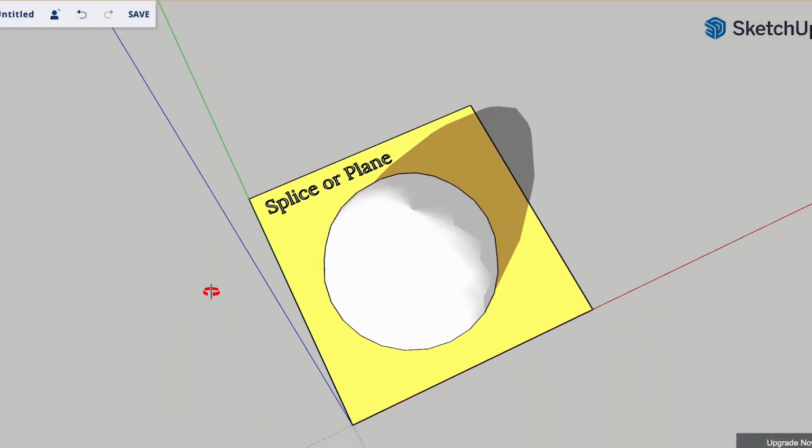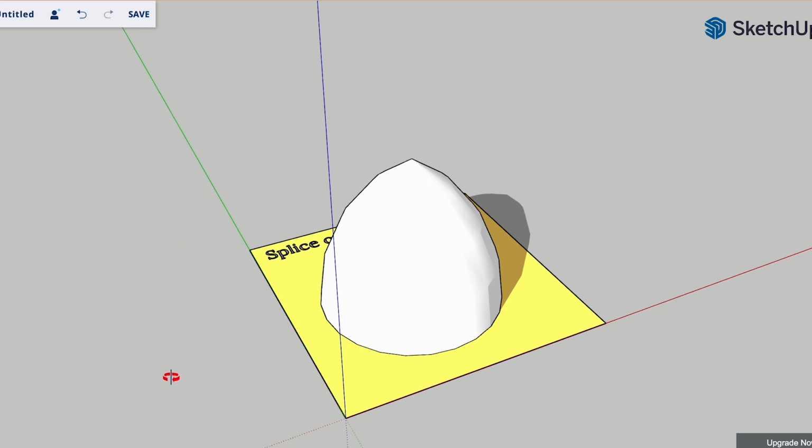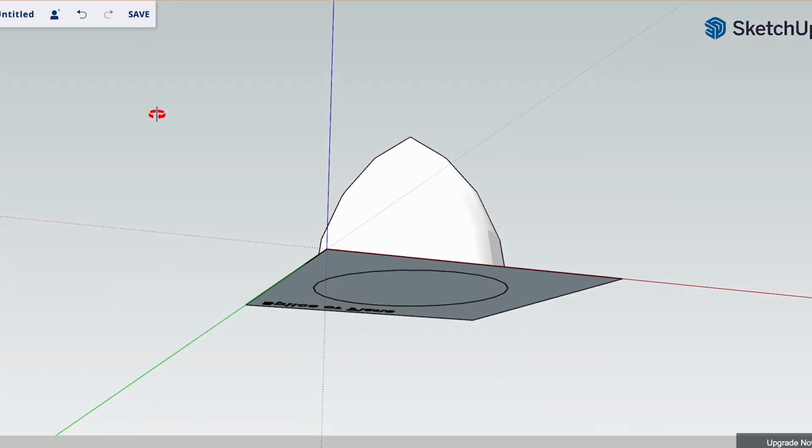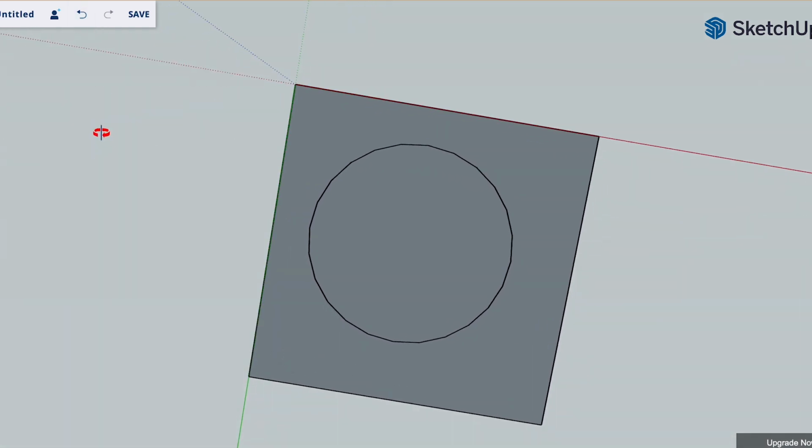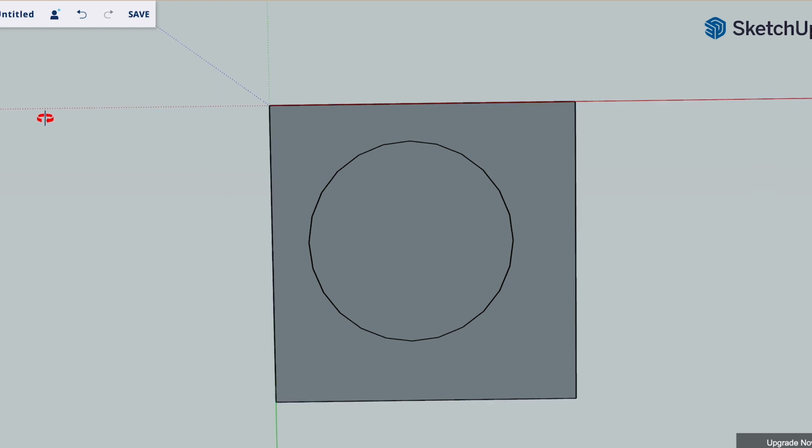Just as our elevation drawing was of only one single plane or slice of our building, our plan view is also of one single plane or slice. The view that's most common is what you'd see at floor level, which is also our spring line of our dome in this exercise. The reason this plane is most commonly chosen for designing domes, but also any other type of standard house or building, is that it can display the most useful information like where furniture will be, where doorways are, and where services will enter through the floor or the concrete slab.